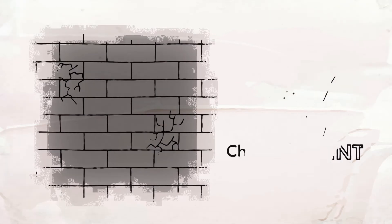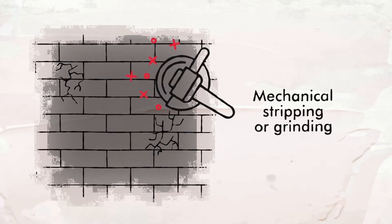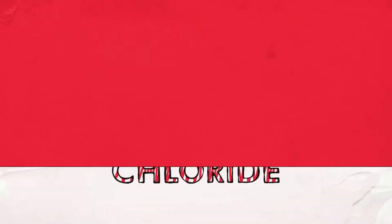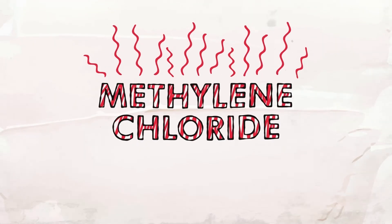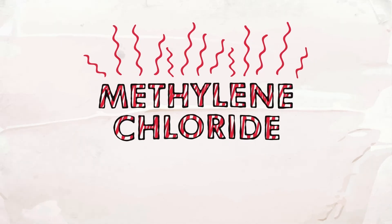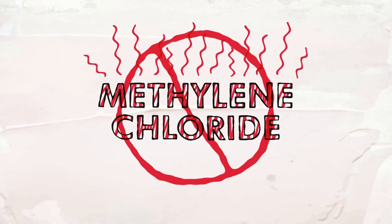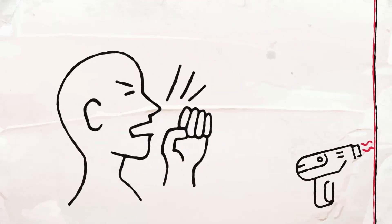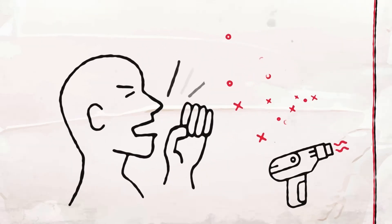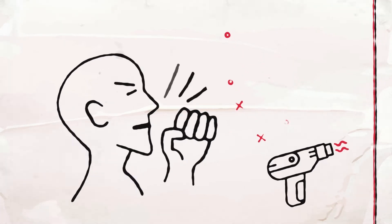There are several different ways to remove coatings: chemical stripping, mechanical grinding, or heat blasting. Some chemical strippers use harsh chemicals such as methylene chloride or NMP. These chemicals are already banned in Europe and can cause serious illness and mutations if people are exposed to them. Mechanical removal and heat blasting can create toxic airborne dust particles and contaminate the area.